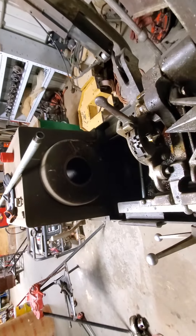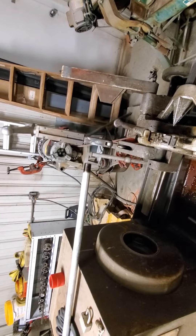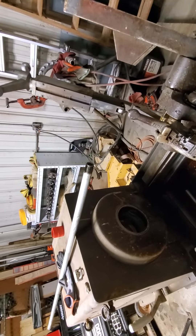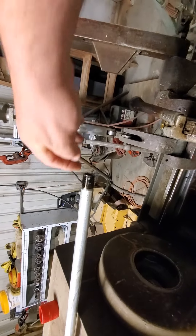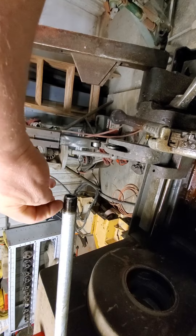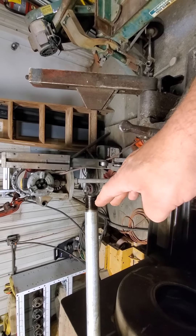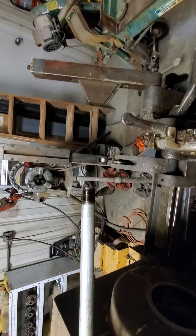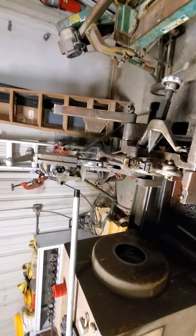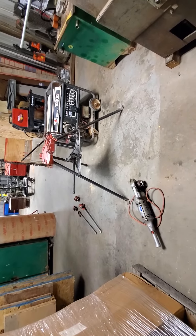That is the basics of how you thread rigid. You pull your measurement — you measure first. Pull your measurement to the outside where your bottom lock ring would be. Then you have to get up in the box. Like I said, five-eighths to three-quarter. My lock ring will probably stop about right here where the threads start thickening out. And then from here to here will be my next lock ring, and then the top will be filled with fiber bushing or a bond bushing depending on your application. So hit like and subscribe, and I hope everybody enjoyed this.